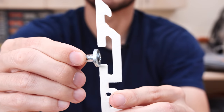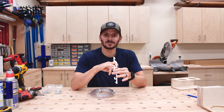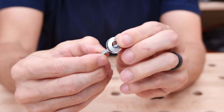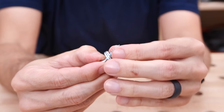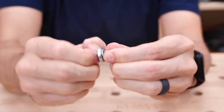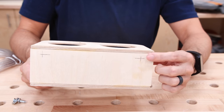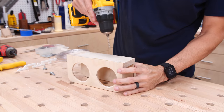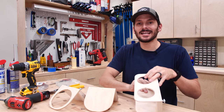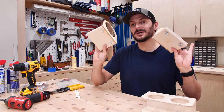This hanger worked out really well. It's going to create a little pocket the size of this little lip — in between the back of whatever you're trying to hang and the back washer. It's just a one inch number eight screw and then two quarter inch washers, then a number eight washer behind that to keep the tubing from going through and to keep the washers in place. This is quarter inch tubing; if you use five-sixteenth tubing you probably wouldn't need that number eight washer. I'm going to mount two of these on the back — I marked the holes so they'll be at the same height from the top so it won't be uneven side to side. After putting in the screws this is ready to hang on the wall. I also went ahead and used the CNC with the same idea to make the holder for that dust hose, and put the DIY hangers on the back as well.